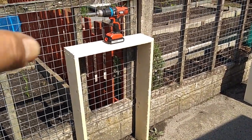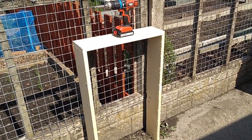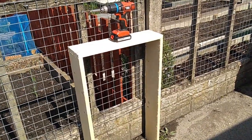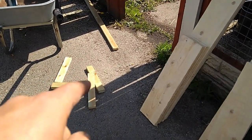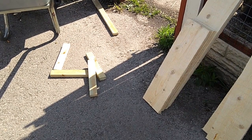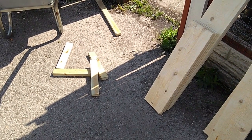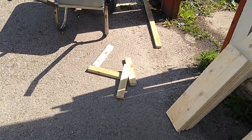When I flip that over and I put the next end piece on at the bottom, that should be square because they're all measured the same, if you like. So that should be square. But to reinforce it then, we'll be making another box, so there's 2 boxes. To reinforce it then, we'll be putting those in as reinforcement fixings, if you like, to it. And for that we'll be using then the 45mm decking screws.